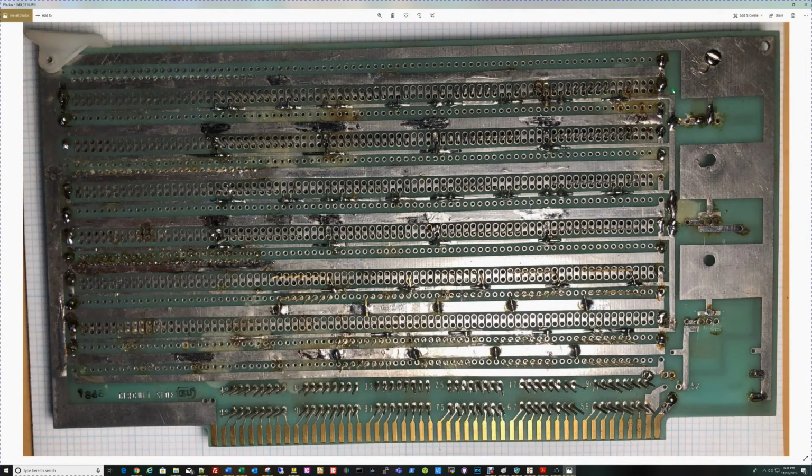And you can somewhat see it here. So we've got pin, I've got to read this correctly. So we've got pin 12. Looks like it's down to, that doesn't seem correct. Have I got a mistake here on the board? That would be a plus power bus. Oh yeah, it goes to +5. So pin 12 goes to +5. It's been bent over and soldered here. There's pin 13, 14, and 15 coming to this +5 bus. And then 23, or is it 24? Anyhow, you can see I've got the pins bent over here on the devices.